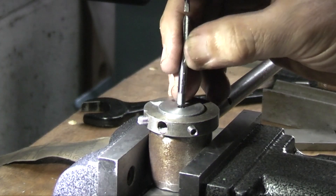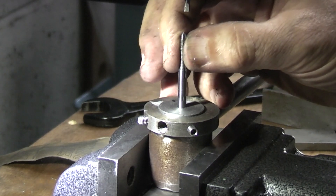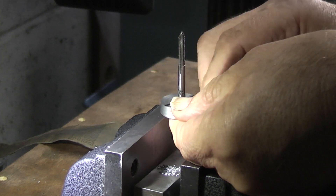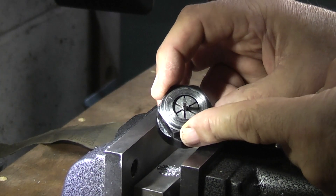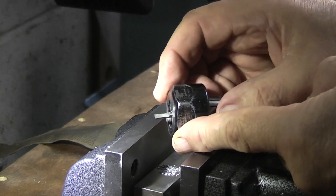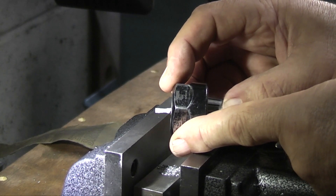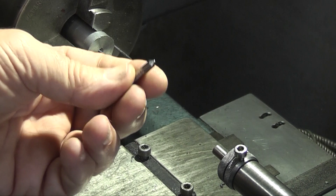I think I've finished - so that fits in there. Here's the hole, so that fits in there easy. Here's the tool - it's just a three millimetre piece of high speed steel. What I did was grind a flat on the front, the main cutting face, that has a slope of two degrees, and then each side I just cleared away about half a mill of the bar so that I could get a corner, so that it would go into the edge on the end of the tap.